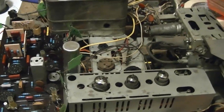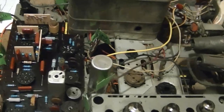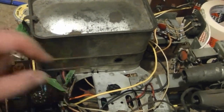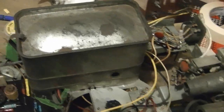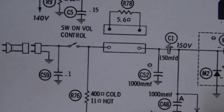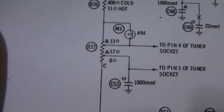Once all that's taken care of, I want to try powering this setup with the fusible resistor pulled out - that would normally go in right here. What that allows me to do is just apply power to the tube filaments. With that out of the circuit, there's no B+ supply to the set - we'll just have power going through the thermistor and this resistor network and so on.